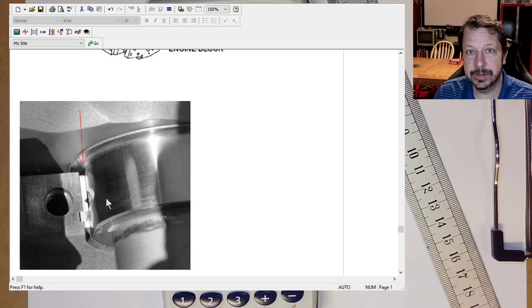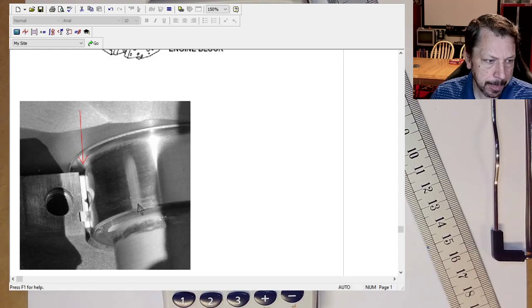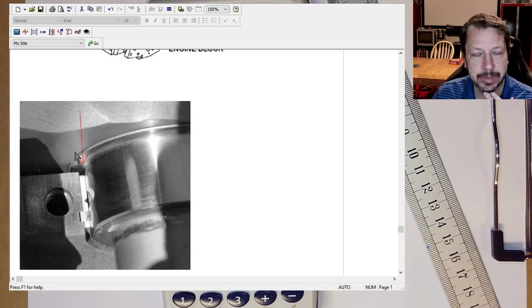When we draw pictures we'll exaggerate the clearances so you can see what's going on. Today we'll go through the introduction and then move to mostly empirical charts. We're going to go through a derivation — or exploration — of what's called Petroff's equation. This equation has a major flaw in its assumptions, but it does produce dimensionless quantities that get used later. The equation itself isn't really used anymore for analysis, but those dimensionless groups are important.